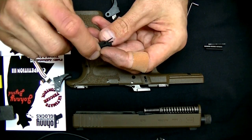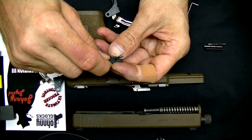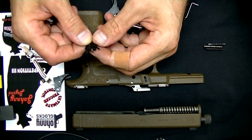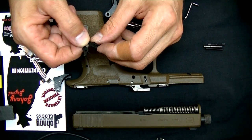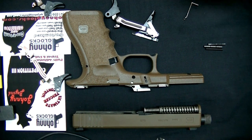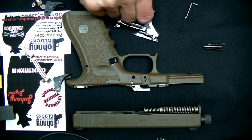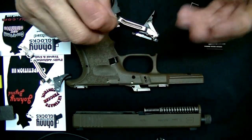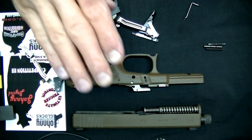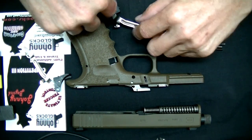If you really match them up, you can see it clearly. When you're cutting a third of the trigger safety off to accommodate for pre-travel, you want to make dang sure this thing is purchasing against the frame. That's what these new modifications are about — safety is number one — to make sure you have a very 100% solid purchase every time when this drops in.